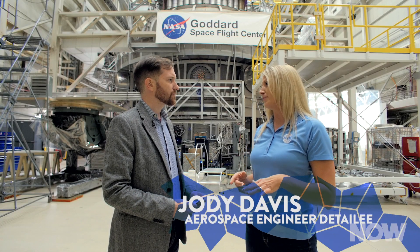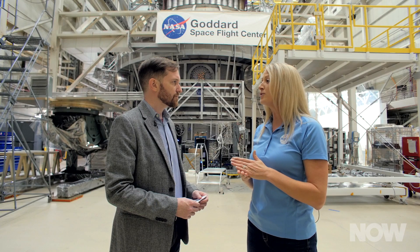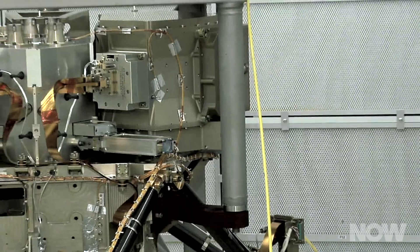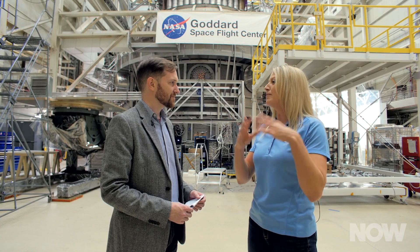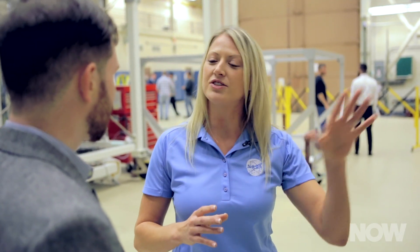So there are four main instruments, and they have near-infrared and mid-infrared capabilities. And those instruments love to be nice and cold — we're talking 40 Kelvin, which is minus 387 degrees Fahrenheit. And then one, the mid-infrared instrument, loves to be at a balmy 7 Kelvin — minus 447 degrees Fahrenheit. So because these instruments are so close to absolute zero, they need to remain cold. Electronics love room temperature, so we need to dissipate all of that heat before we get to the science instruments. So we have what's called a harness radiator.